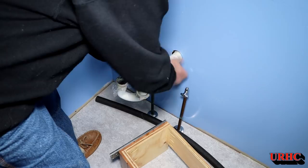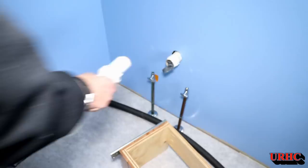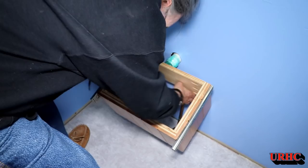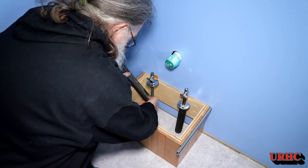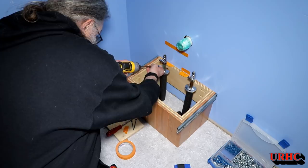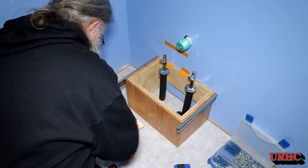Time to go up and install this. I had left the plumbing on before, so I pulled that out, plugged the hole, and did a double seal with shrink wrap just to be safe — you don't want that smell in the house. I love this shrink wrap. Now I can just slide the pedestal down in place, and I'm going to put some pipe insulation around the pipes because in the summertime everything gets condensation on it. It takes two minutes to put the insulation on. Then after taking some measurements and finding the studs, I put some large screws into the wall to position and hold it in place.